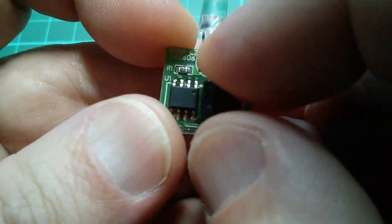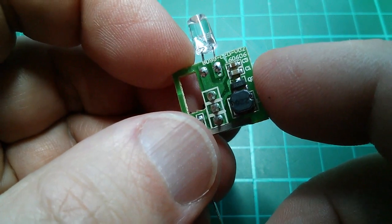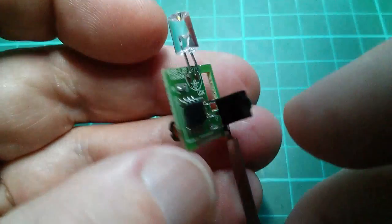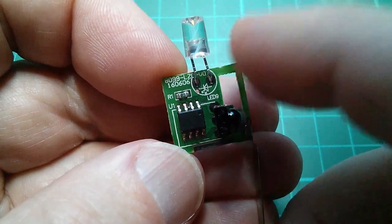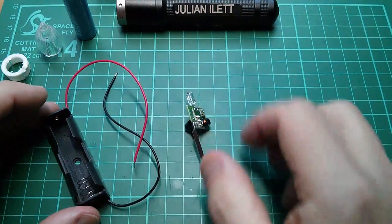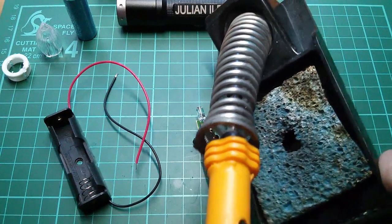Let's see if the chip is anonymous or has a number on it — it looks like it's anonymous, can't see anything on there. On the back there's a device I can't quite read. There's an inductor there, presumably to boost 1.5 volts up to around 3 volts. So now the question is, when I put the flickering LED in there — I suppose I'm just going to shove it in and see what happens. I'm going to solder on a single AA holder so I can get this thing powered up, and then replace the LED with a flickering LED.